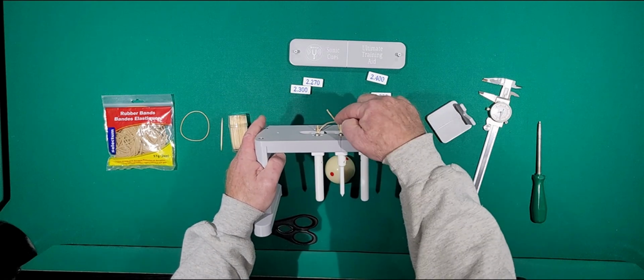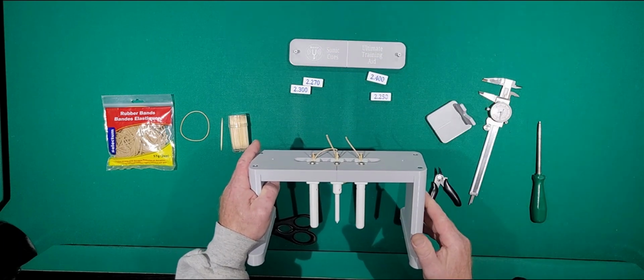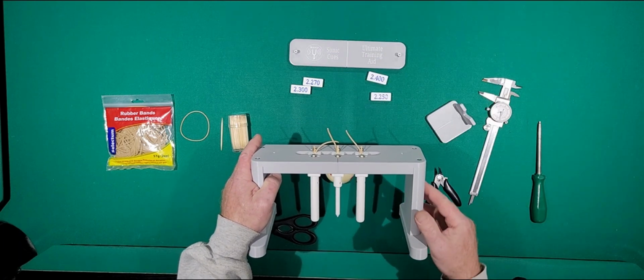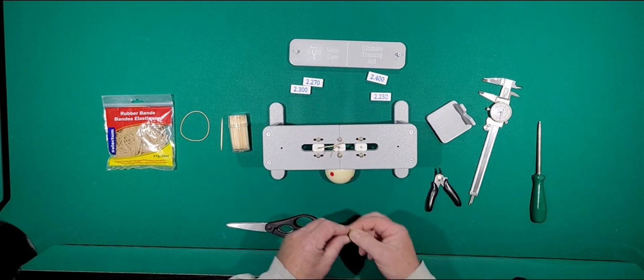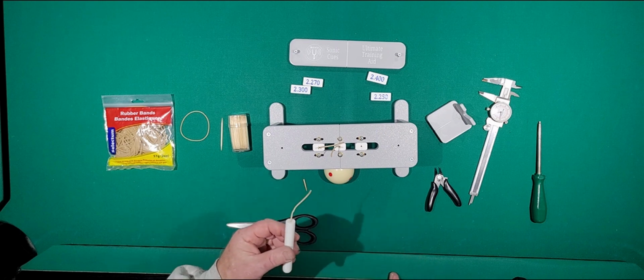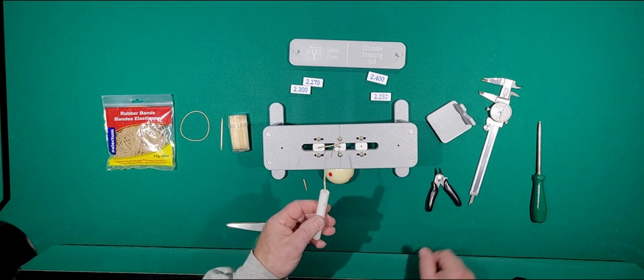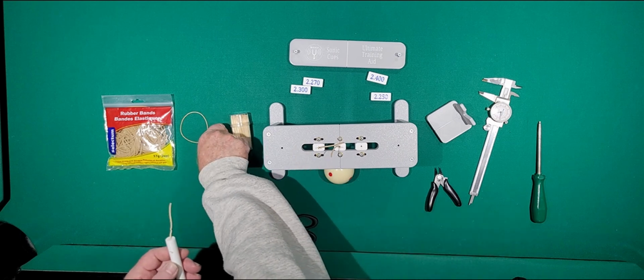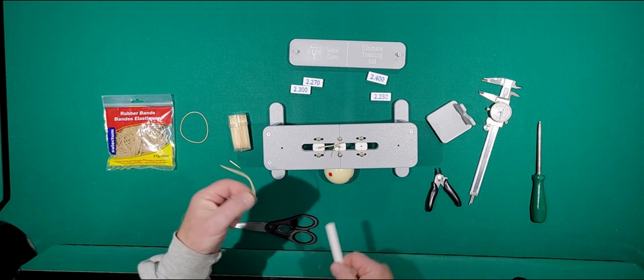If you make the tension of the elastic band too tight, they will wear out faster. You don't need a lot of tension, and we'll go through that. But right now, we'll pop one out. So we'll replace this elastic band, which in the real world would be broken right now. I'll get the remaining part of the elastic band out of there.